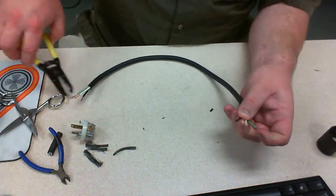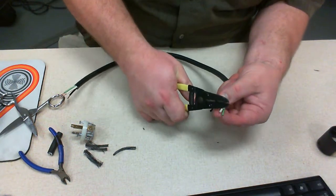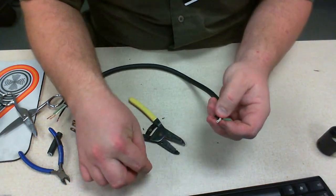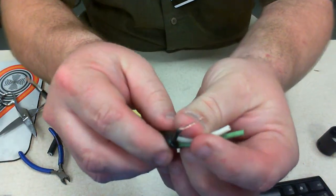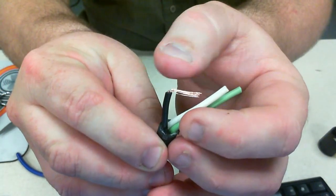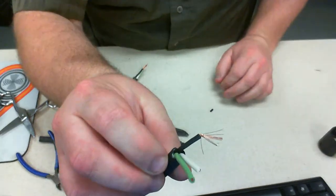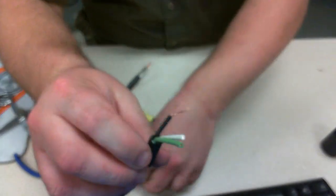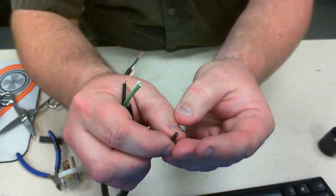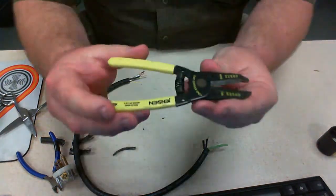I'm going to measure this, snip it here, and take my wire strippers and just do this the wrong way. I stripped that out — I yanked on it and I did that perfectly again. I can ruin things, let me tell you. There are little hairs sticking up right there. The reason there are little hairs is because I clipped a lot of the strands. Most of those strands are actually stuck in the cabling, and the reason they're stuck in there is because I used the wrong snips. I deliberately used the wrong snips.